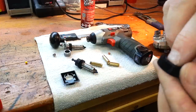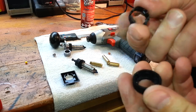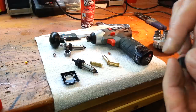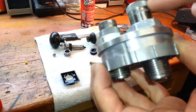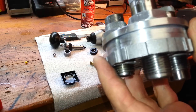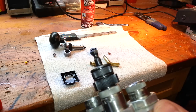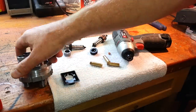But at $19, MSRP $25, it's worth working with. I was able to go on the Lee Precision website and order these rings for $1 apiece — I got four of them just to have on hand. When they ride on the bushing they ride on this surface, so I could see that wearing over time. Now, this is the die specific for the 300 blackout that you have to order — about $10. It fits in here and the cool thing about this, what makes it a power trim, is this device here is able to go into a drill or a nut driver or something that provides the RPM to cut.